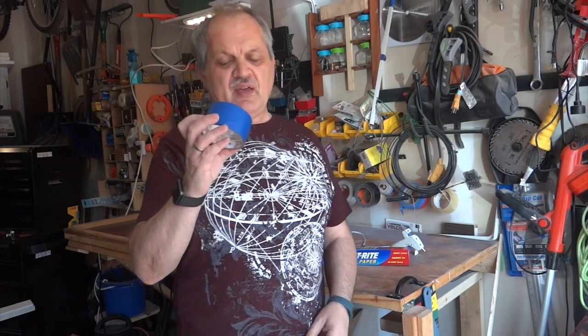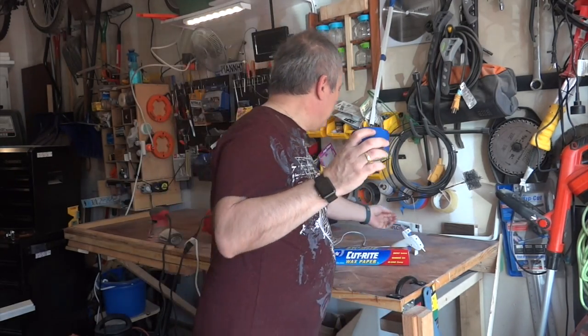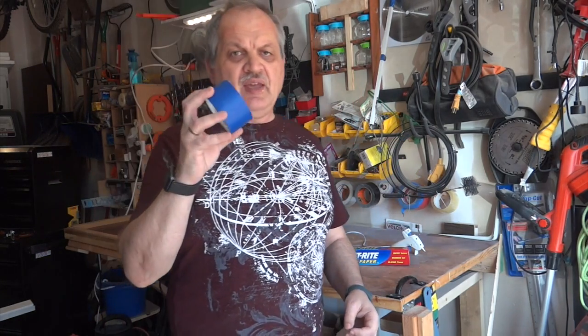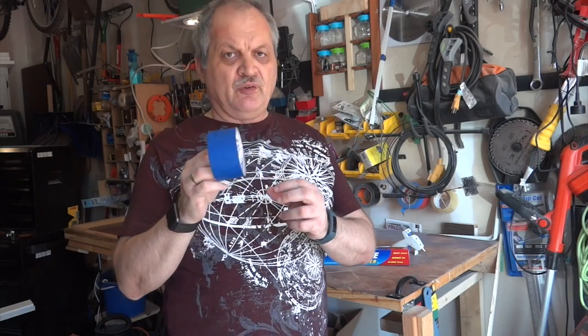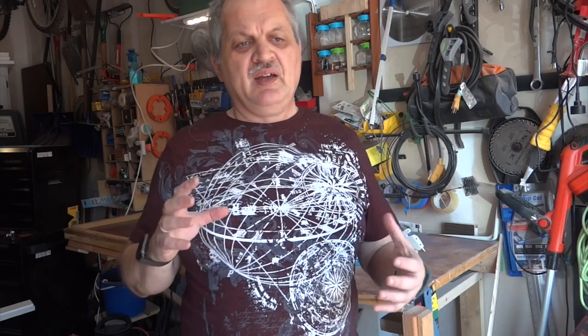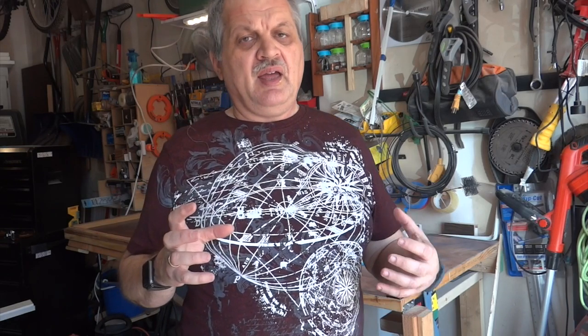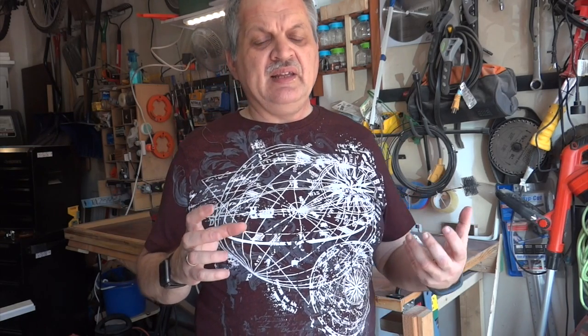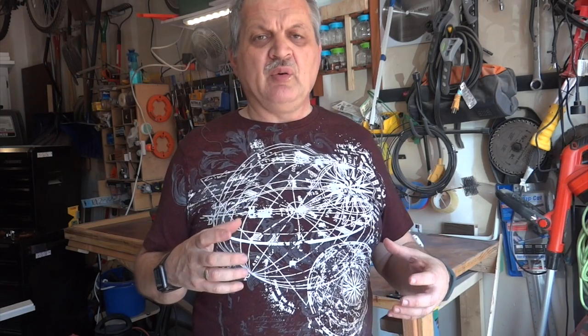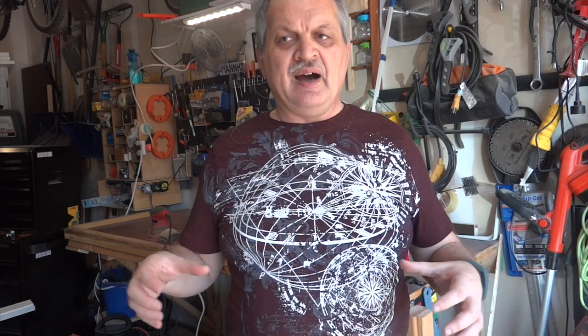Another item you should always have in hand, actually I have 2 rolls here, maybe 3, is painter's tape. This is indispensable for your shop. Painter's tape makes a very inexpensive clamping system, and it additionally can define areas that you don't want to cut, or you can put it when you use a jigsaw that tends to make rough cuts, and if you tape that area, it will prevent any tear out.